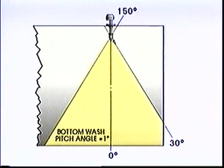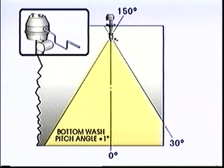Since you don't want to wash the bulkheads again, you have to make the nozzles turn back down at 30 degrees on their way up. Use the hand crank. There is no other way than cranking the nozzle all the way up to 150 degrees and down to 30 degrees again. Turn off the water before you crank the guns and keep track of what you're doing.